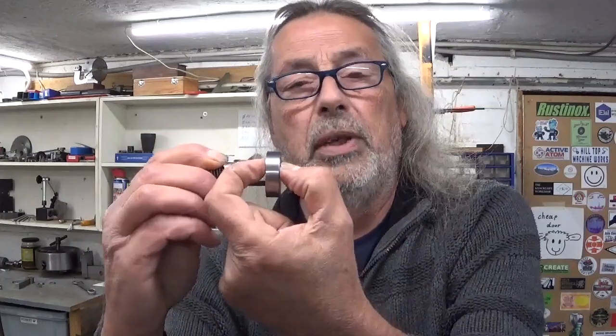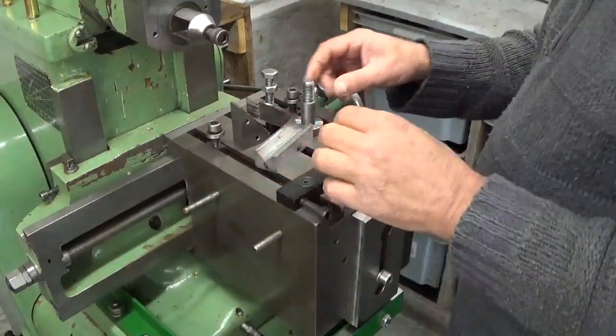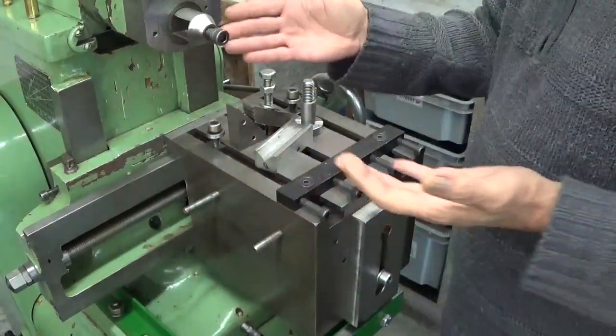I just gave the thing a little clean up and I took off 5mm of this thickness here. Now I left 10mm here. I think it will be more than strong enough. Okay, cut two flats here. That I will do here in the shaper because today I feel like playing with the shaper.